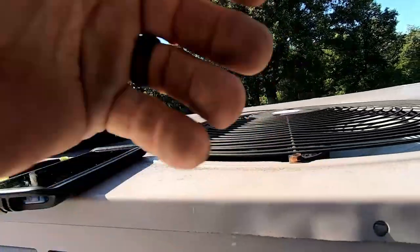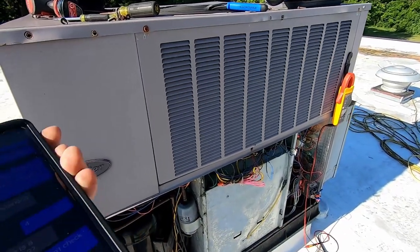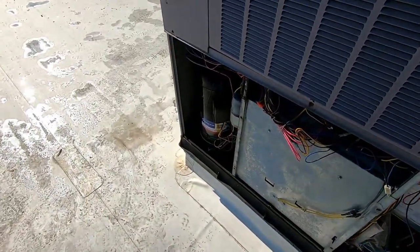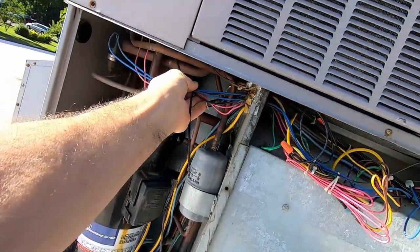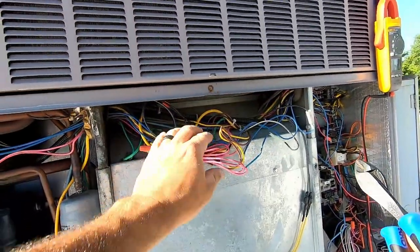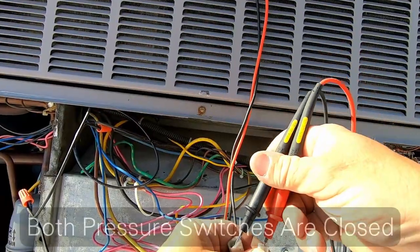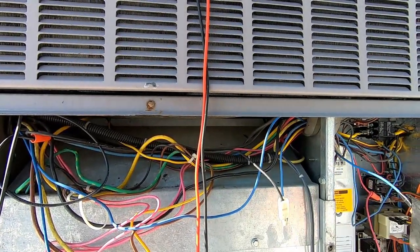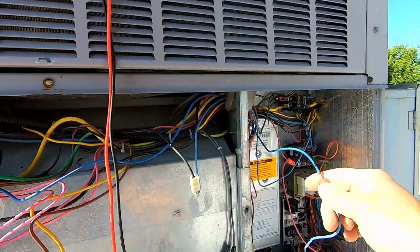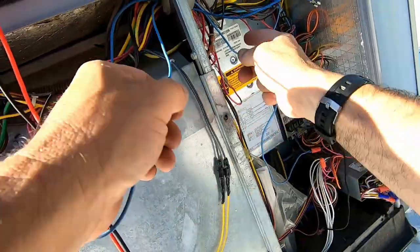I think it's hidden in there somewhere. The unit just tried to start again on its own. At this point I'm just going to kill the power. We'll go through and check these switches — the blue wire comes into here. What we can do is bypass all that garbage. This comes out of here on that terminal and comes back on black — on blue, I should say.